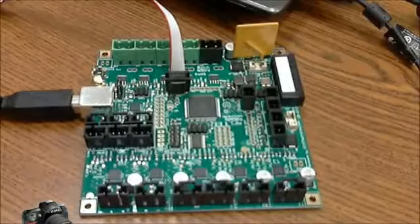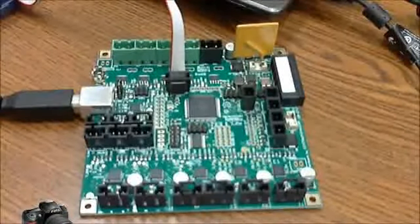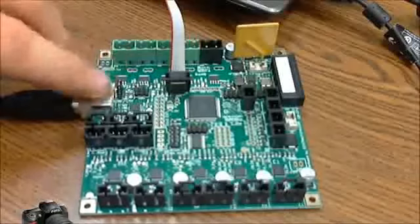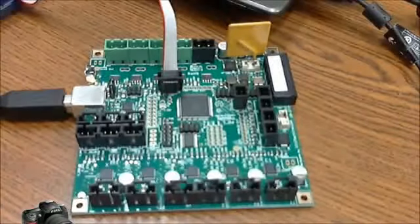There was a glitch — when we flashed firmware at the shop with the programmer, the script actually overwrote and erased the bootloader that was on the chip. That's why some people were getting boards where they could not re-upload firmware using USB — the bootloader was erased when the board got programmed.